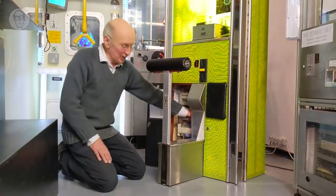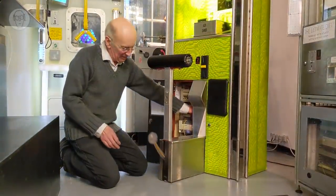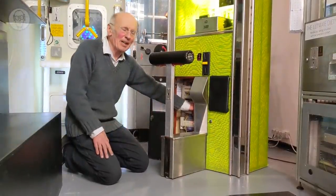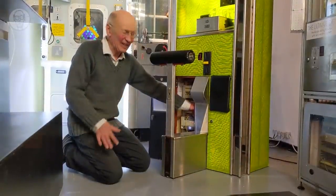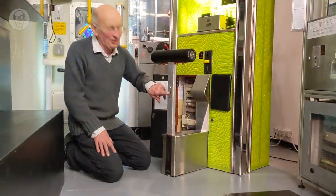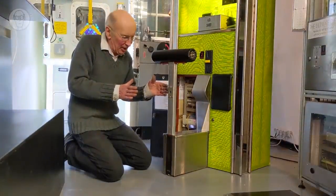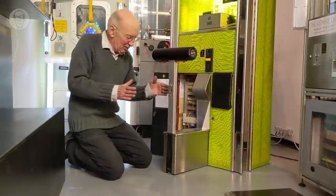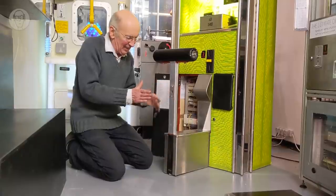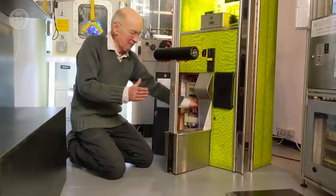The entire alien probe machine was designed around the end gag of the actual anal probe. It doesn't come out that hard, so it couldn't do anybody any serious damage, but I thought it might scare a child, or possibly even knock over a toddler or something. So I added a diffuse opto sensor in here. And the great thing is, it was quite a posh one where I could adjust the range really accurately. So if it senses anything in the way up to about here, but if it's just out of the path of the probe, it lets the probe work as normal.